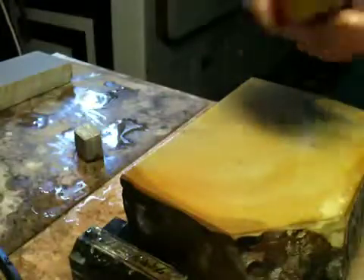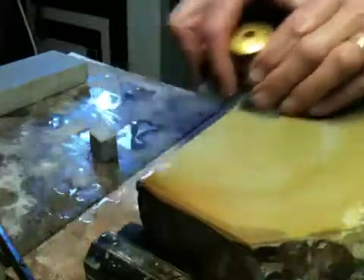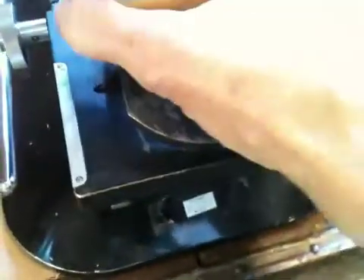We're going to back the blade out, go back over to the stone, and with just clear water I'm going to do another set of 20. I was working just in the center part of the blade. Dry that off — you can see already how the center part of the blade has changed in its sheen.